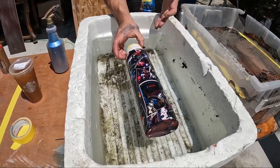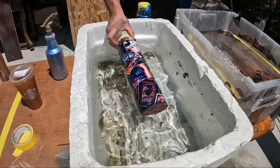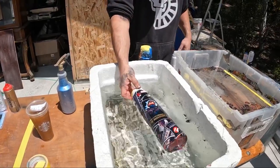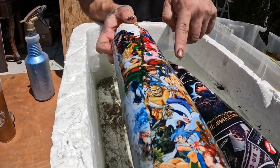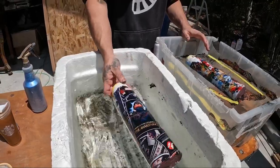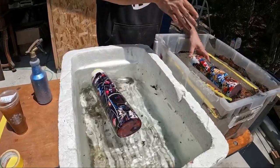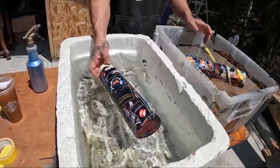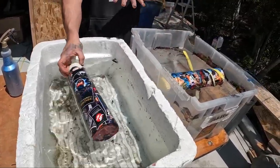The design came out perfect, everything looks nice. We have a small bit of white showing where the activation wasn't perfect, but we can touch that up with black paint for a flawless finish. Next we're going to clear coat this — the final part of the dipping process. Every time you dip a part it comes out with a slime on it. To remove the slime: leave the part in the water for a while and spin it, or use a hose to spray it off. If you want to save water, just leave it in for about 15 minutes and it'll come off on its own. Then let it dry in the sun and clear coat it.